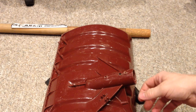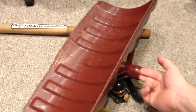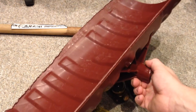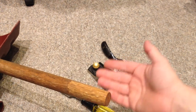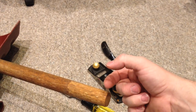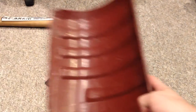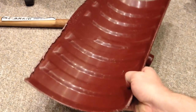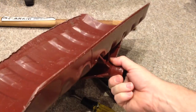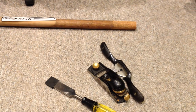If the handle is too loose in the socket, the first second you lift some snow it's going to rotate on you — that's why you need a screw. But don't split the handle with the screw, so pre-drill where the screw goes. The screw doesn't have to be especially long, just strong enough to prevent rotation. On a shovel loaded with wet snow there can be quite a bit of torque on the handle rotating sideways.